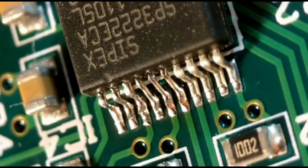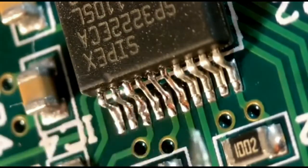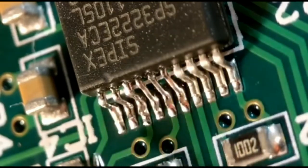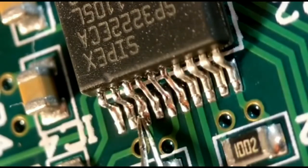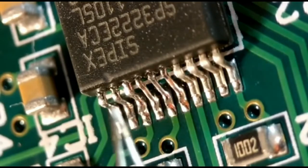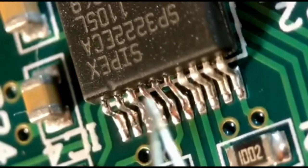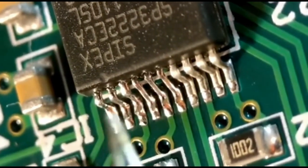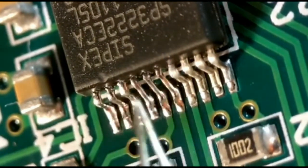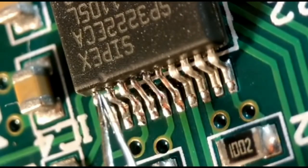This is the finished board. I repeated the operation for the remaining two pins — literally gone along the top and soldered them all up. You can see nice joints right on the top and right down the bottom. So to compare: for three pins I transposed pins from another IC, and for the other three I used Kynar wire shaped like a pin. The results are pretty amazing compared to what we started with. All you have to do is expose a little bit of copper in the IC body and that gives you a base to work with.